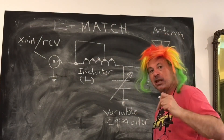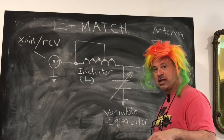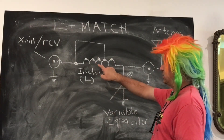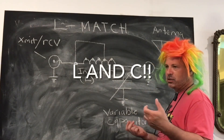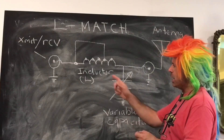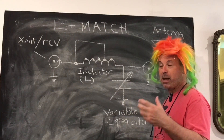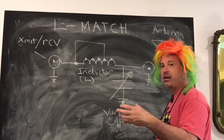If you go to the link below, I do a basic lecture on antennas and antenna theory. Jump into that link because basically an antenna behaves like a tuned circuit — it's got a balance of inductance and capacitance. Sometimes when things get out of balance, or the antenna is too short or too long, you can add a little bit of inductance or capacitance, which brings it up to resonance or makes the transmitter think the antenna is resonant, allowing transfer of power.